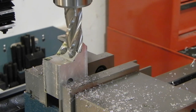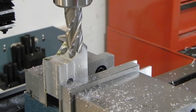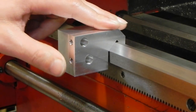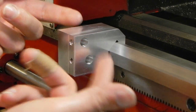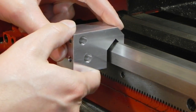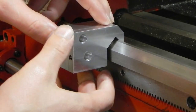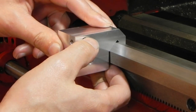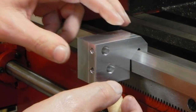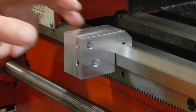Okay, that's it. I'm going to clean this up and take it over to the lathe and we'll see if it fits. Here it is — I've got it mounted up on the lathe. I've got two magnets in the bores right now, they're not Loctite-ed in, but they're in there. It moves around a little bit and you can see the magnets just pull out. But I think these two magnets will be pretty good — they'll produce enough force, maybe even a little too much. They're going to hold it in place and then that big thumb screw underneath will lock it down.